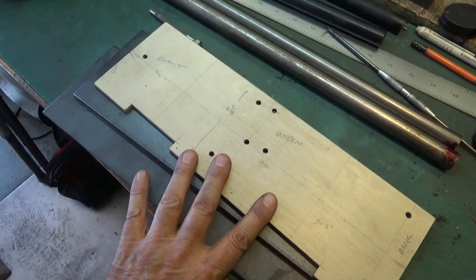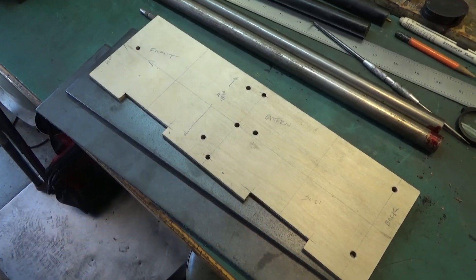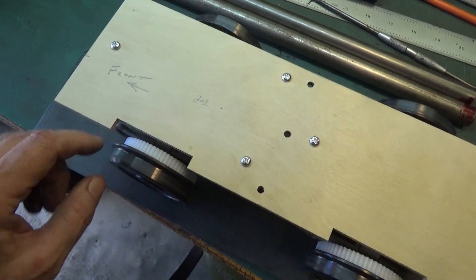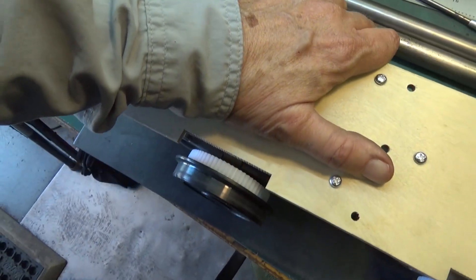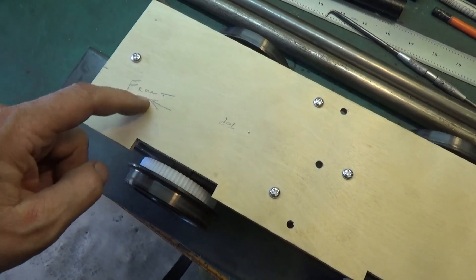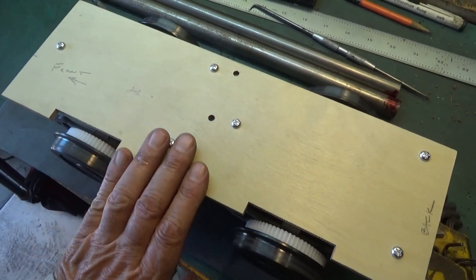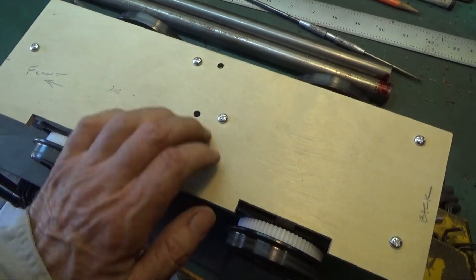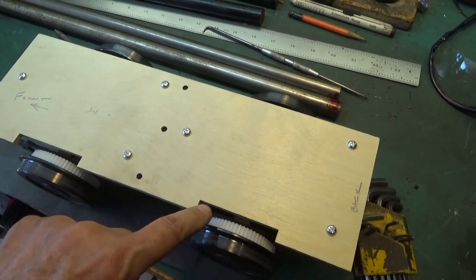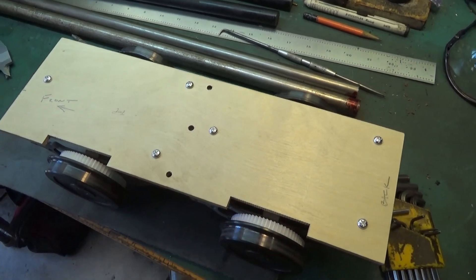So here are the two metal plates and this pattern that shows where the notches go, and this will be the same for each plate. While Bob is getting that ready on the mill, you can see this is not a precision cut — it's just a relief cut, so that any deflection of this chassis on the bogey does not cause this steel, or in this case plywood, to come in contact with this Delrin gear. Probably the angle grinder would be okay technology to carve this out, just like I did this on the table saw. But we're going to go first class and get these gouged out on the mill.